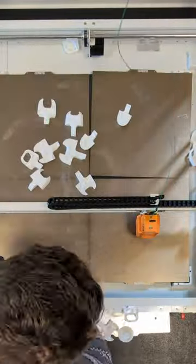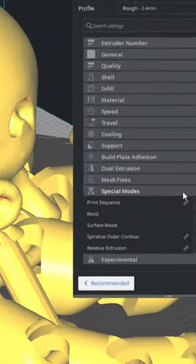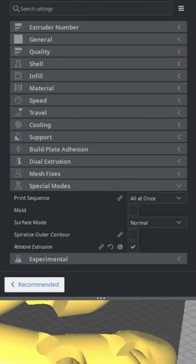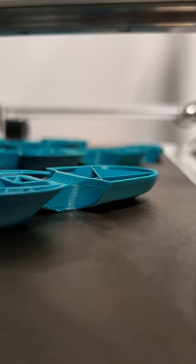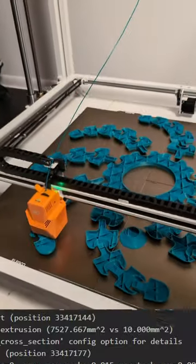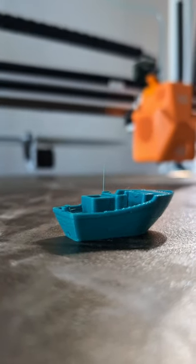The second white one failed because of a slicer and firmware issue. Elegoo Cura by default uses absolute extrusion, so in the G-code file it continues to count up and gets to very large extrusion values. Then when you need to change out the spools, the resume function changes to relative extrusion, and it tried to extrude 7,527 millimeters in one movement. Luckily, that does trigger an error and ends the print.